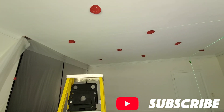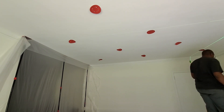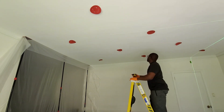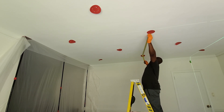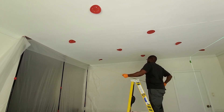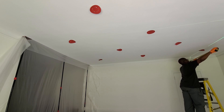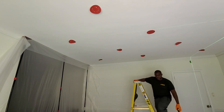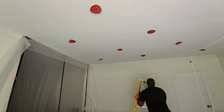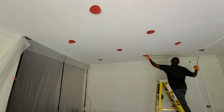In the previous installment, we had nine placeholders in our ceiling for our recessed lights. After meeting with the client, it was determined that the nine light location layout was too predictable — we just had three rows of three, and it kind of drew your eyes to it and was underwhelming. So we went ahead and added four additional light locations, giving us a total of 13, which breaks up the overall design so your eyes aren't automatically drawn to three lines of three. As a result, we had to go back and space out all of our light locations again.